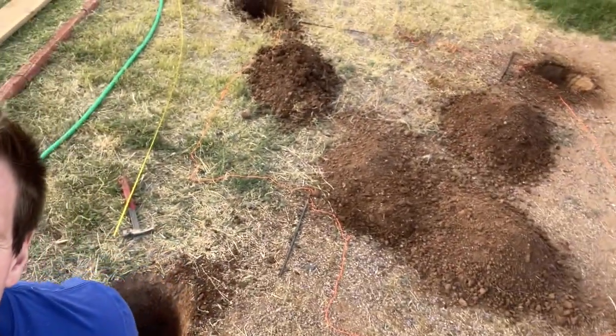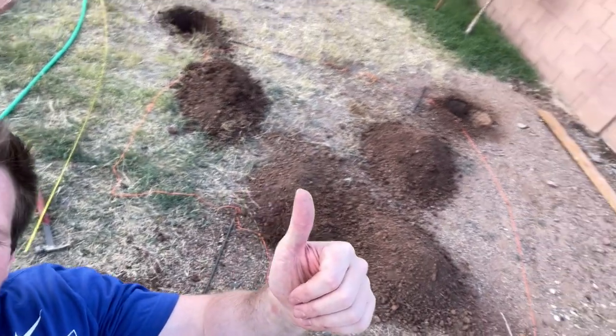Okay, that was pretty brutal. I just dug four holes about 10 feet apart, making a square, so check it out. And then I have some centering to do so I can get the concrete form tubes to be equidistant from each other. And then I can move on to setting the concrete and the post bases in the concrete. So I got my weekend cut out for me, but for now I'm gonna go take a break, and we'll be back first thing in the morning.